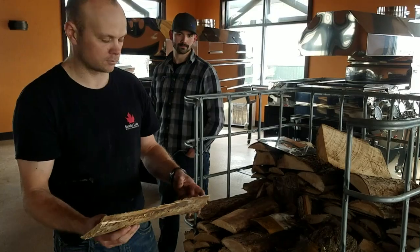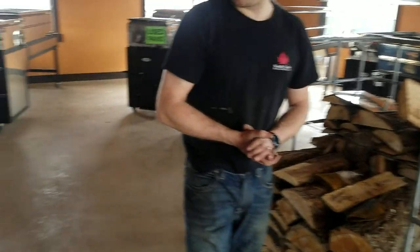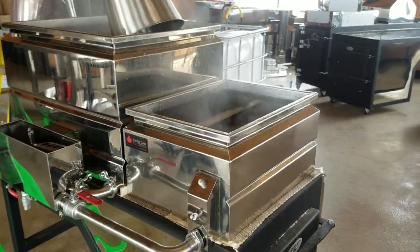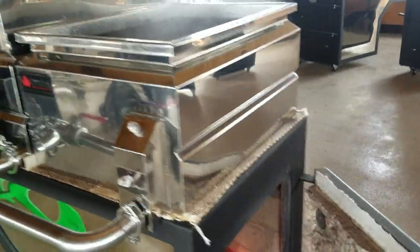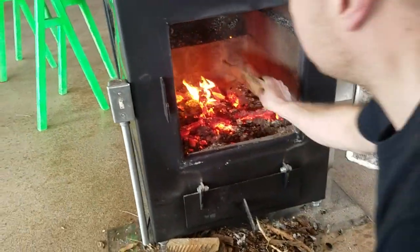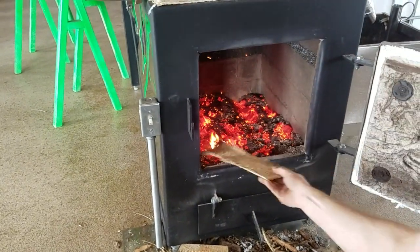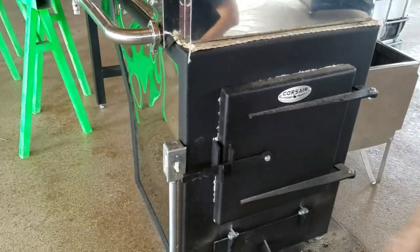This smaller stuff burns away in a minute or so. By the time my head tank is full, I have maybe about an inch or an inch and a quarter in the flue pan and about an inch and a half in the front pan. This is what I want the fire box to look like — just some hot coals. I spread those around evenly, and I keep on running my force draft. This is a force draft evaporator, and I keep it running right until it's empty.